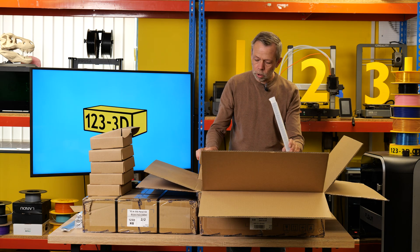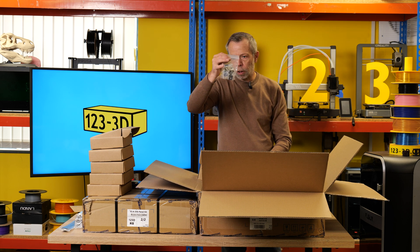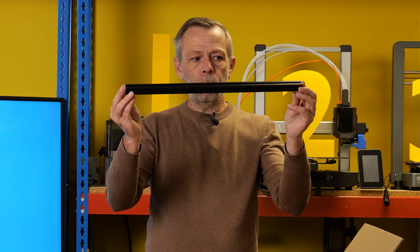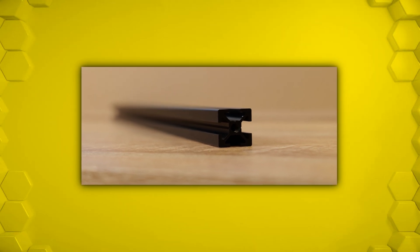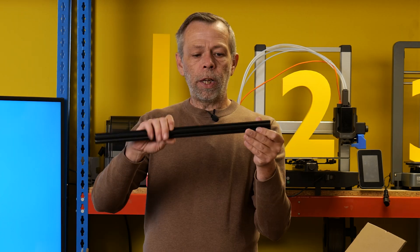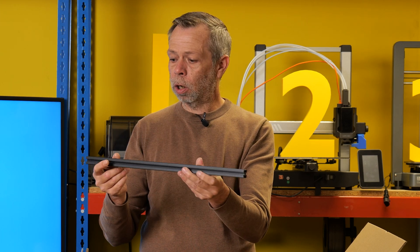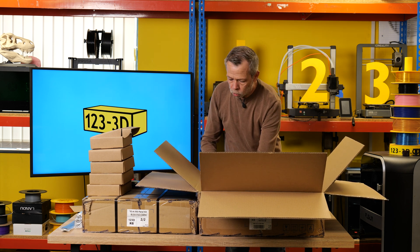The frame box contains the black aluminium angled corners for fixing the bed rails. I'll pull out one extrusion as they are packaged very nicely and I don't want to scratch or damage them. These are LDO rails - nicely tapped, finished incredibly nicely. There's no cheap anodising on this aluminium. From everything I've read, seen, and heard, these are cut to perfection, tapped perfectly, with no excess swarf from the cutting or tapping process. These will be the first part of our assembly.